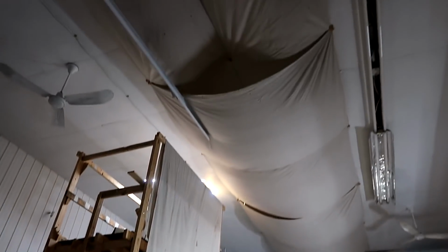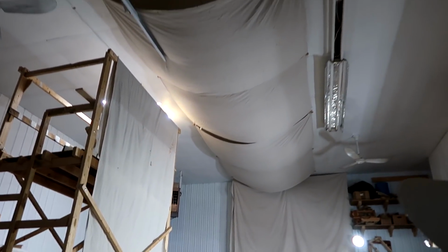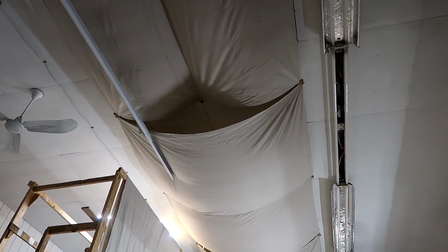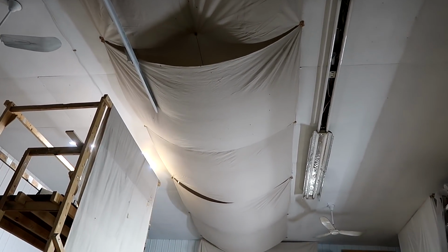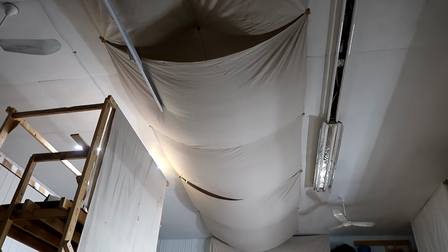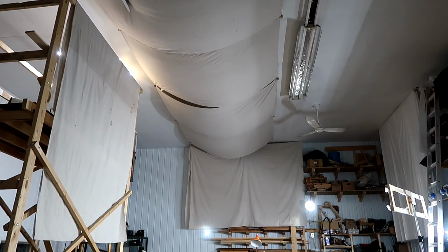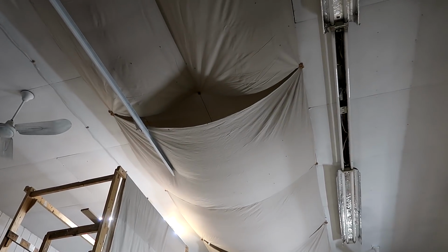And by the way, all those drop cloths you see hanging here and there, that's echo cancellation, or, well, sound dampening. Some people mount expensive sound dampening panels. I just stretch a drop cloth. The drop cloth is probably less than half as effective as a sound dampening panel, but it covers a much bigger area. So say it's 1/3 as effective and I cover 4 times the area, I still get more sound dampening.